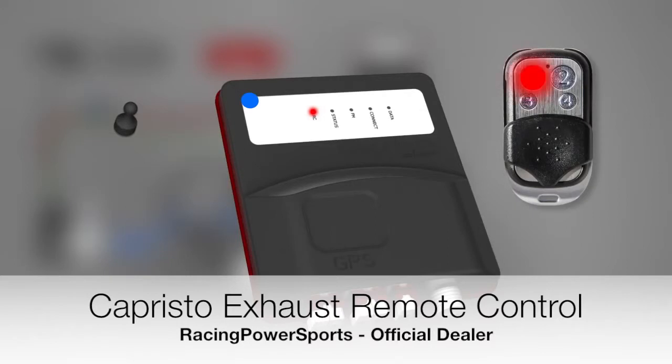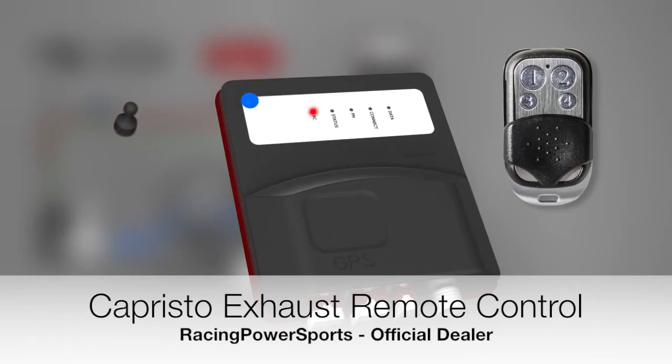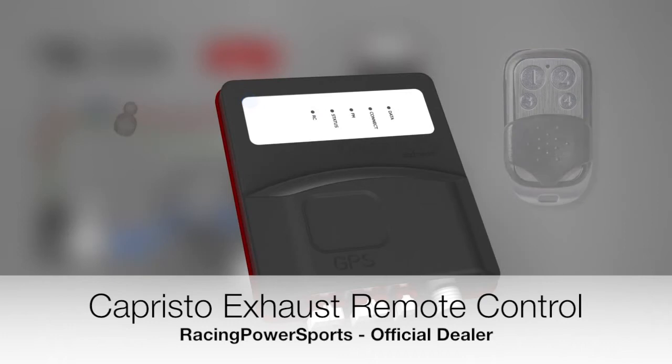Shortly press button 1 on the key fob. The RC LED will turn off. Press button 1 again and the RC LED blinks until the new key fob's registration process is completed. The key fob can now be used. The key fobs can only be erased altogether, not individually. To delete all key fobs, hold the magnet to this spot for at least 10 seconds. The RC LED will light up. Remove the magnet after 10 seconds. Now the LED will blink for some seconds until all key fobs are deleted.